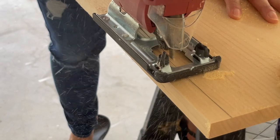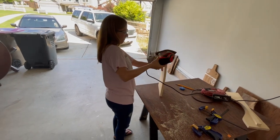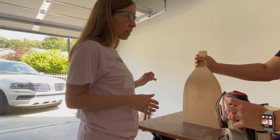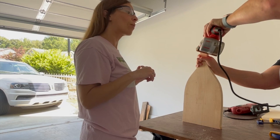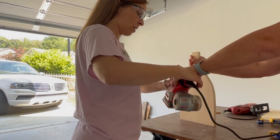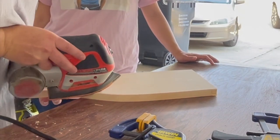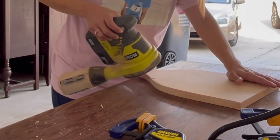Against the grain of the wood, you kind of need to slow down. Next, we go to the sander where we can fix some of those mistakes. She started sanding in the air and was having trouble, so I showed her to ground her project against the table, keep the sander level on top of it, and slightly rotate it left and right to round those edges. Then we take the gouge that happened from the jigsaw and sand those edges so it looks like it was gouged out a long time ago rather than a fresh pop-out.